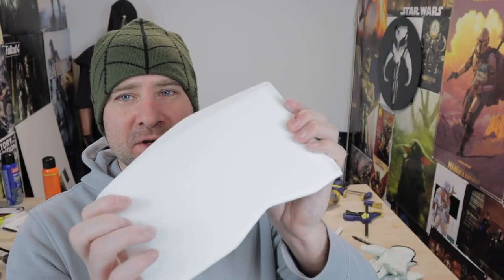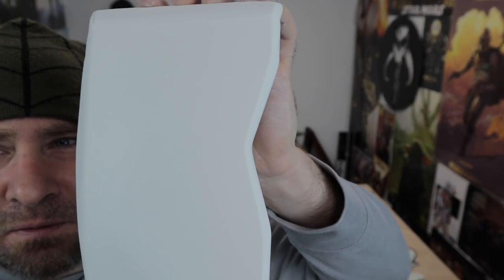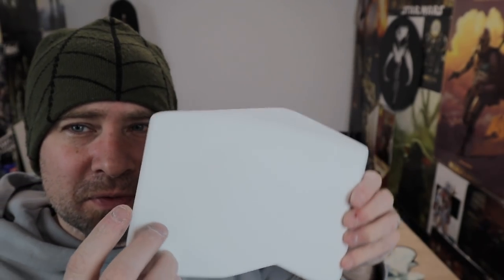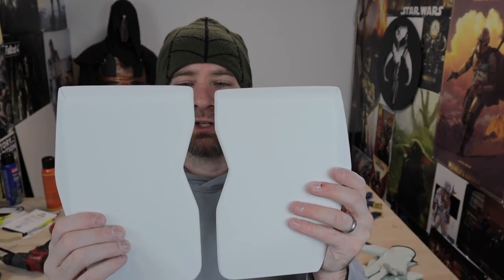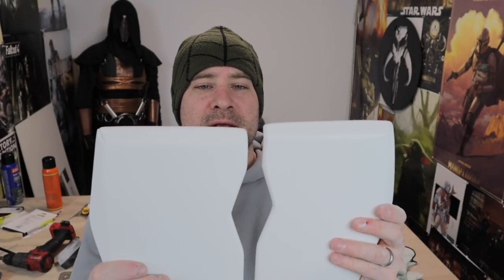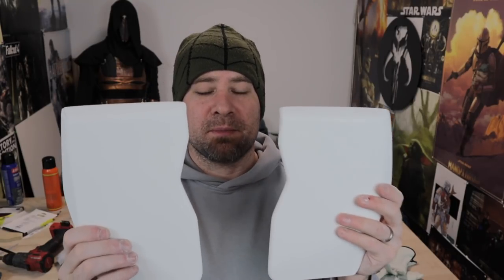All right. There's one thing I could say about this PVC board, Sintra, whatever you want to call it, is it sands really nice. And you can really finish out your part to make it look smooth and pretty if you take your time with the sanding, especially making your edges nice and straight and then really prepping this, because I'm really happy with that. I believe we've got a pretty close matching set. We are on our way. Even though this has been a big pain in the butt, I think it's gonna pan out in the end. So let's keep on marching forward.